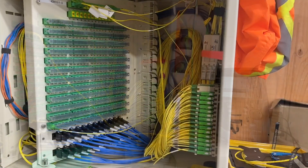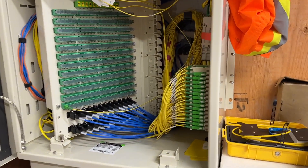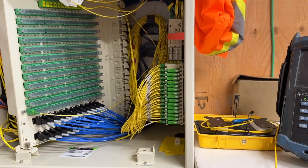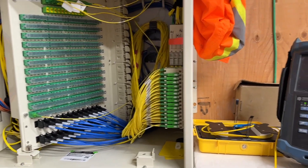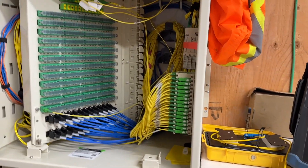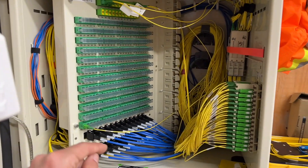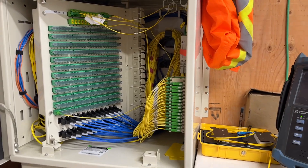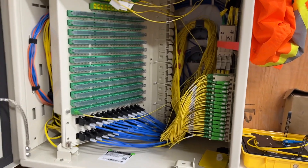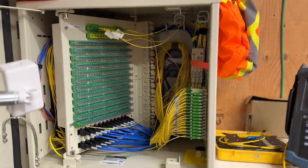All right guys, we got through the whole cabinet — just shut the OTDR down and unplugged our launch blocks. We went through the whole cabinet — the most we ran into was simple connector losses and a little bit of dirt. Quick clean and the majority came back nice. If not, we threw our comment in there. That's going to do it for this video. Hope you guys enjoyed it — throw your comments and questions in the comment section, smash that like button, hit that subscribe button. Until the next one, thanks for watching.